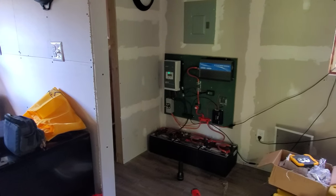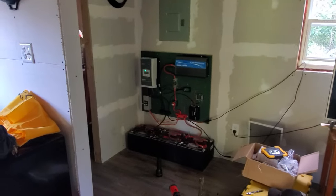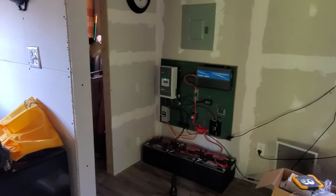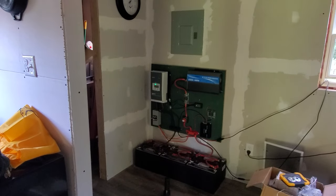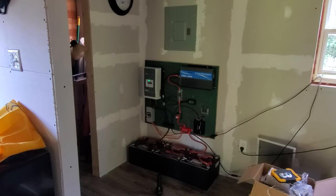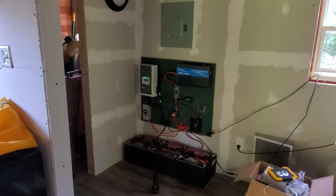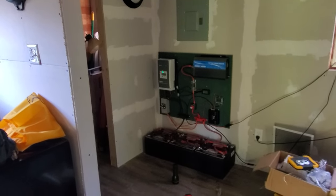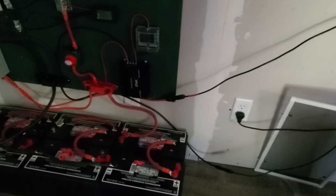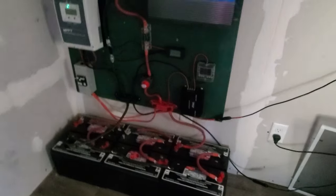Because I first ran all of my 6-gauge wire — I've got 6 AWG for when I hook up all the panels. Now there has been a change of plan because of the panels. 10 is a nice round number, except in solar panels — 3 is the number you want. So I'm going to put the other 6 panels up, change these 4 out, and run them 3 in series, 3 parallels. That's why I need the 6 AWG wire. I barely had enough 8 AWG wire to test this thing out, and had to make little extensions to run over.